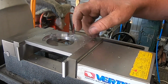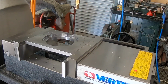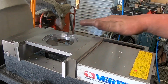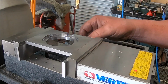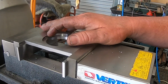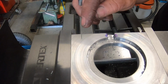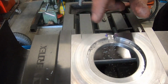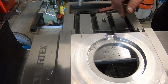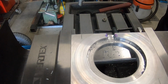Okay. Take it out and deburr it. Before I do that, I might mark these holes out first and drill these 4 holes. Now I think I should do that first, save setting it up twice. I'm just going to do each hole, like spot it, change it out, instead of going around all 4 and then going around all 4 again. So they're only going out to 6.5 mil. So it's only 4 to do.